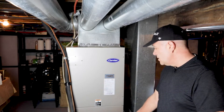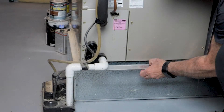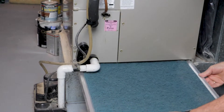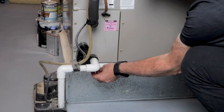This unit happens to have the filter at the bottom, so we go down to the bottom of the unit and remove the filter. We're going to replace the filter — we don't want to pump dirty air, and we don't want the fan motor working any harder than it has to trying to force air through a dirty filter. So we want to get it all cleaned up and ready to go.